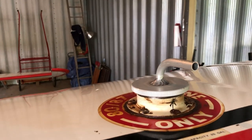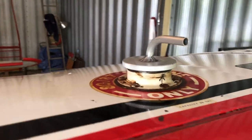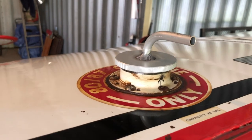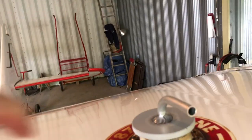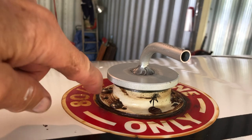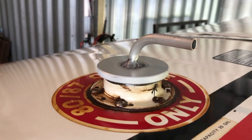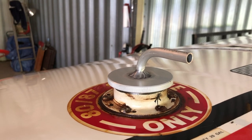This is the day after. I put the new fuel caps on and also resealed the necks. I believe we've got the problem solved — probably a few more flights to know for sure. I filled it up just below the neck, and typically when I have a problem the fuel, when it expands and it's hot, will tend to seep out. I saw nothing. We're going to do a couple-hour flight and see how she goes and I'll report back.